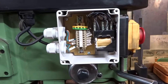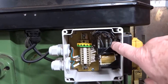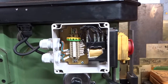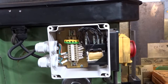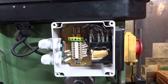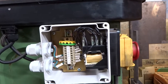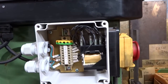about that. One of the things I've been wondering about is whether this is the original contactor on off switch for the original single phase motor, and whether in some fashion it's possible to wire that in. Obviously the single phase in will be okay, but whether it's possible to wire that in some fashion to start stop the inverter, or at least to run the inverter.